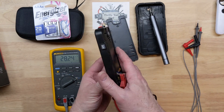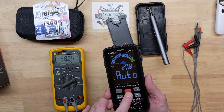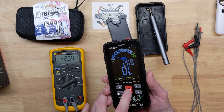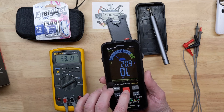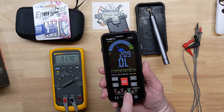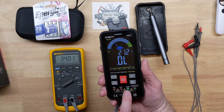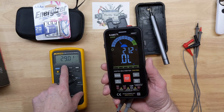We're at about 28 milliamps — I'm pretty satisfied with that, especially for a color LCD display with that much backlight. When we change modes we see five blinks of the jack indicators, and it fluctuates from about 28 to 33–34 milliamps. That only happens for five blinks, so it's not a concern.